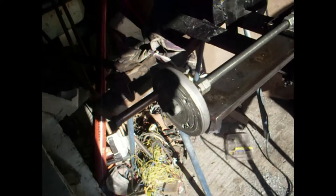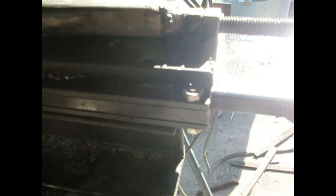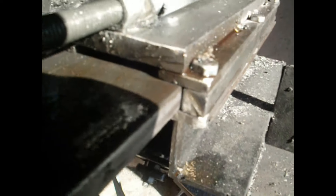What we have got today is we have modified the top slide, and it's really very, very nice on the movement. What we have done is we have got this 75 by 12 flat bar — yes, it is 75 by 12 — and then this is a 12 by 12 square bar. Then we have got some 25 by 5 flat bar bolted to it, so it actually makes it clamped. I don't know if you can see that — clamped on the 12 mil bar, with two plates on either side of that.